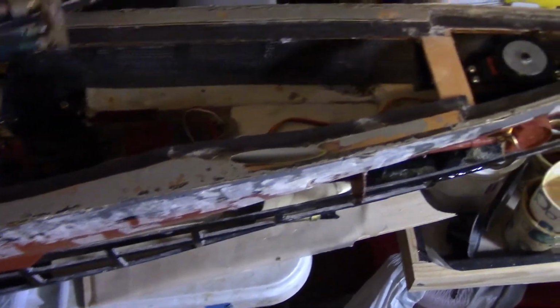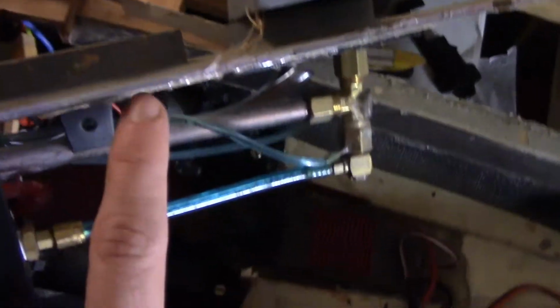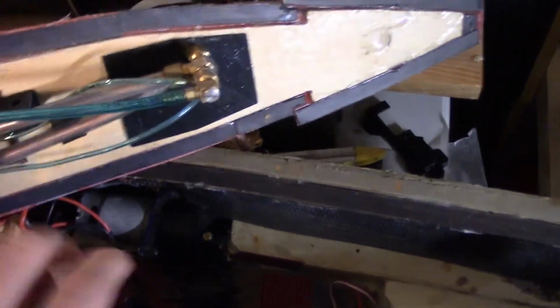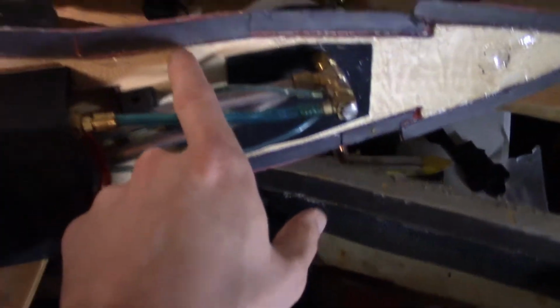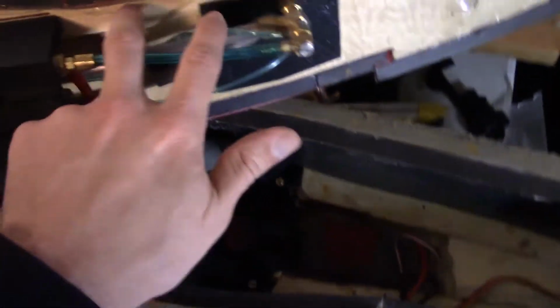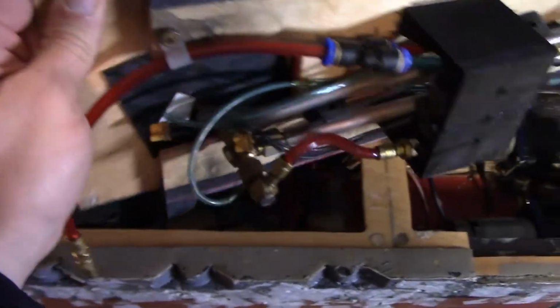In this case, you can kind of see the red material there. The red material is just 1/16 inch thick fiberglass. As you can imagine, that's really flimsy, so what I then did is I reinforced it. This is a 1/8 inch piece of plywood, kind of inset, so it doesn't interfere with the deck rim. That 1/8 inch thick plywood gives the fiberglass the strength it needs. And then at top, I have the standard 1/8 inch thick plywood.